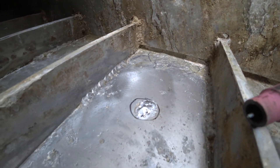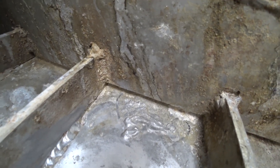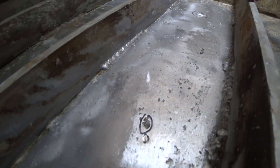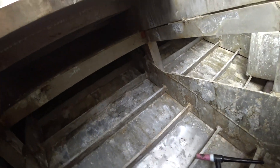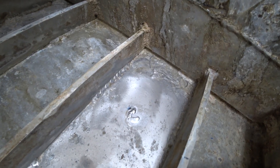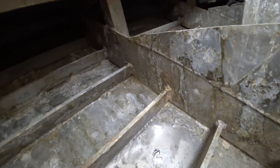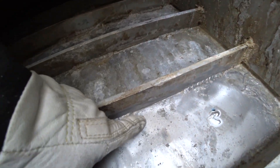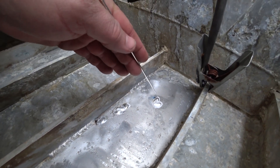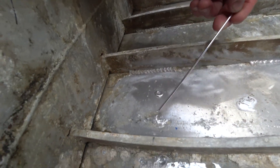You can see that little area there - the low bit. Over here you can see where somebody's done a bit of pad welding before to build up another little bit of damage. There are a couple of other spots we'll be working on as well. I'll do this piece down here. As you can see, I've gone over it a second time and filled up those low spots. Just noticed another little low spot in here - we'll fill that in as well.